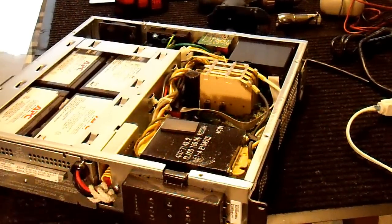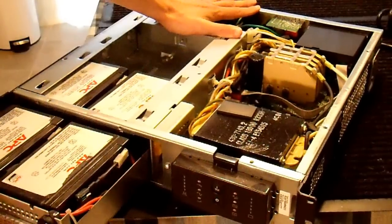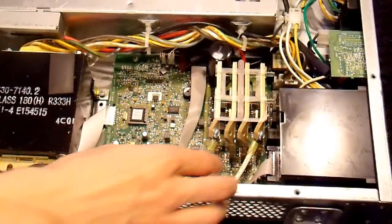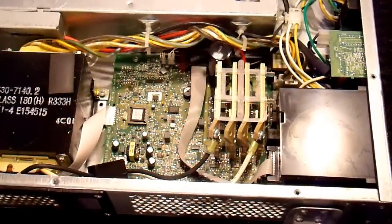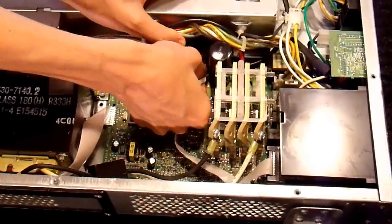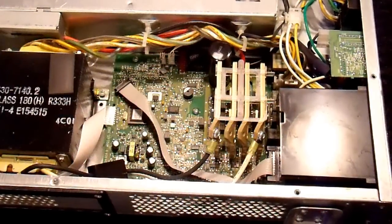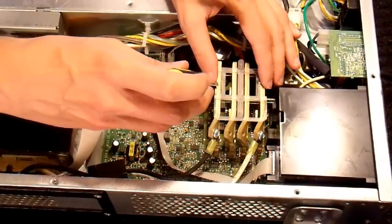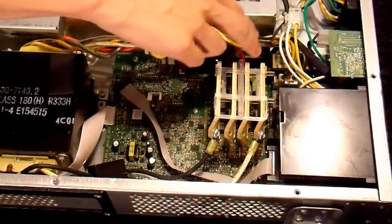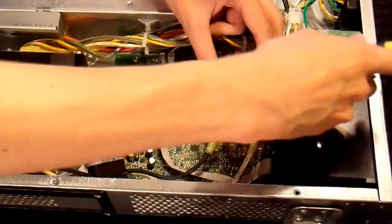The first thing I'm gonna do is remove this 30-pound battery and set that aside because it really doesn't do anybody any good anymore. Next, I want to get this expansion module box out of the way — it covers things up and I can't see. I think they have an ethernet add-in that you can optionally put in here, but I don't need that. So I'll unplug this. They have this plastic spacer thing on the heat sinks — on the FETs — that gets in the way of removing this. There are a couple of little tabs here you have to pry out. It's best not to break this because you do need it to keep these heat sinks from contacting the grounded case of the unit, and also to keep them separated so they don't vibrate and run into each other and short out. That would be bad.